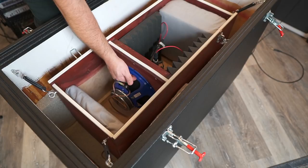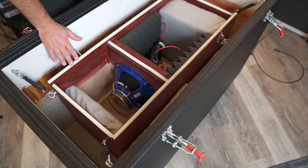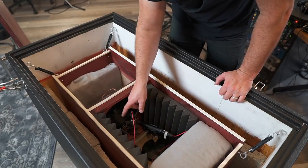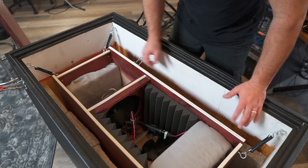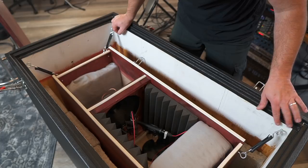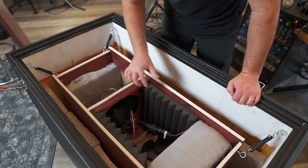What we see here is actually acoustic treatment — this is Echo Cell. You could use 703 or 705 or any sort of studio-grade insulation. In here we've got a couple of real short stands with the Beyerdynamic M201 and a Royer R121, and I just tried to stuff it full of insulation as much as I can. I built this inner cabinet and then hung it on these straps. These are just rubber bungees with holes all the way through them, with eye bolts going in and S-hooks holding the bungees. This whole thing floats in here — it's completely suspended on its own.